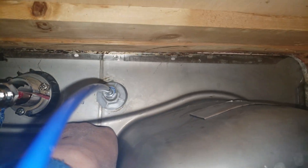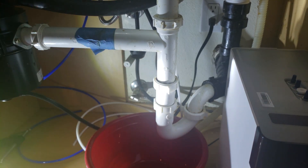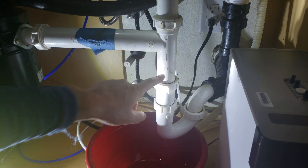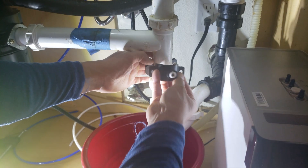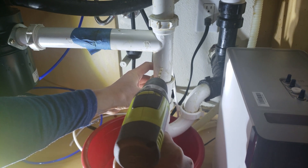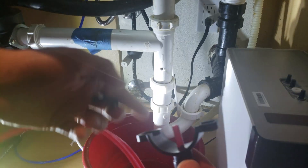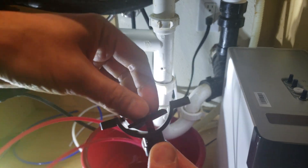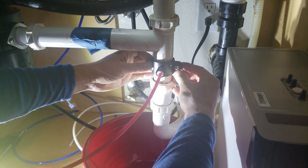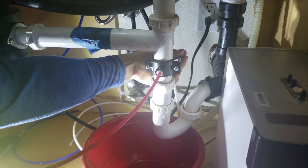Check that there are no holes or gaps — looks tight. The next step is to drill a quarter-inch hole into the drain pipe for the wastewater system. If you have to drill in a horizontal area due to space constraints, make sure you drill on the top, not on the bottom. There's already a marking here that looks like a central location to fit the bracket — let's go ahead and drill that quarter-inch hole.